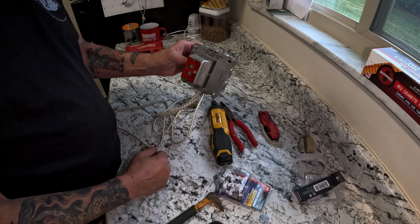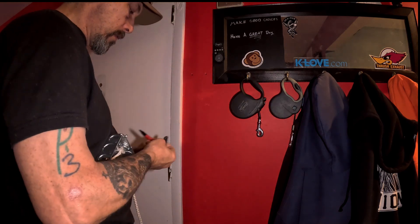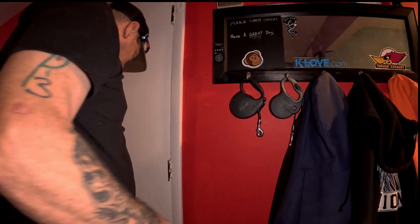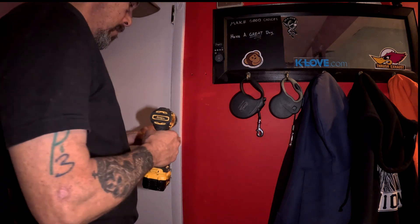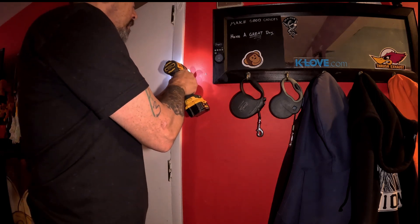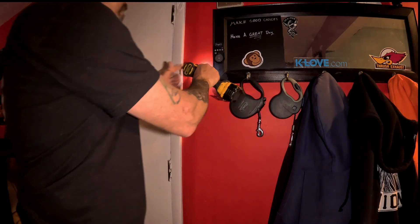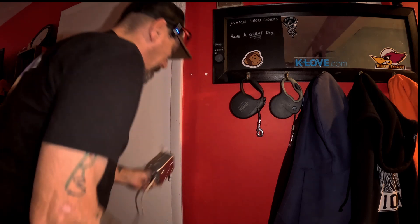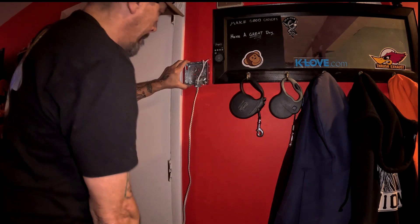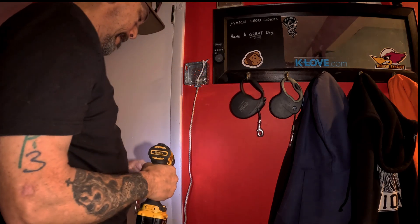Run your transformer wire over and I'll show you how I'm going to do it. I put my box up here and mark where my mounts are going to go. I'm going to use screw-in mollies with a couple of screws. What I like to do first is run the screws in to open up the wall a little bit. That one has a stud in it, so I don't need a molly for that side — just one molly and one regular screw.